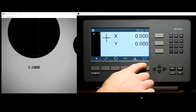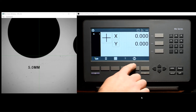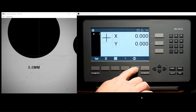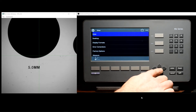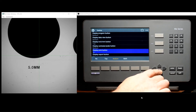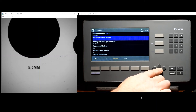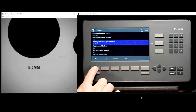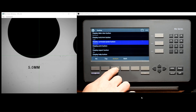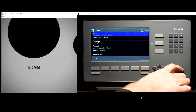The functions available in the soft key positions can be customized in the desktop settings screen. If you do not see one of the functions you're looking for, simply navigate to the MX setup menu using the MX button, enter setup, and scroll to desktop. In the desktop menu, you'll find each of the supported functions that can be mapped to the top or bottom toolbar. Simply choose whether to disable that function with the No soft key, add it only to the top toolbar with the Top soft key, to the bottom toolbar only with the Bottom key, or to both toolbars. Press Finish to accept your choices.